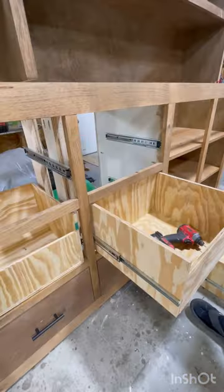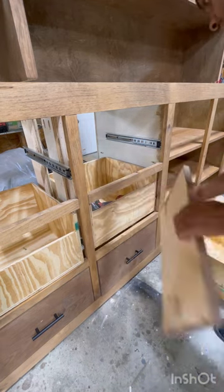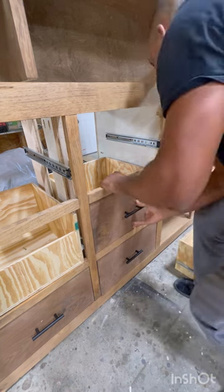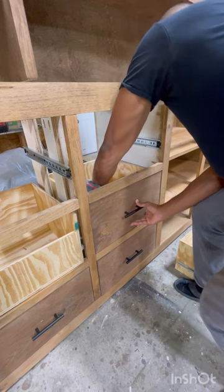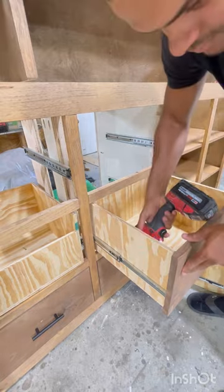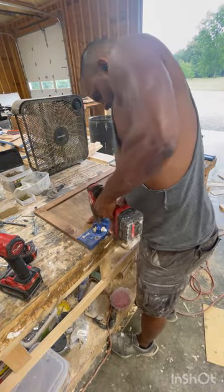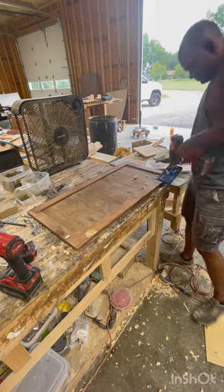I use the same scrap piece of wood, set my drawer slide on it so that whenever I come back to do the boxes of the drawers, that's how high my drawer slide needs to be. There are a hundred different ways to do drawers — that's just the way I do it. From here I just cut the faces of the drawers, put the handle on, and use a little inch screw to hold those in. Then you see all those pocket holes going up — that's what holds the top down so the shiny part doesn't move.